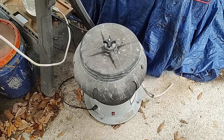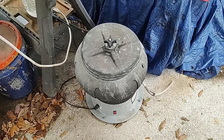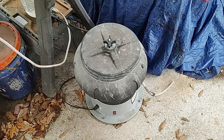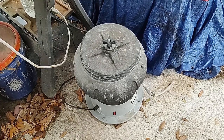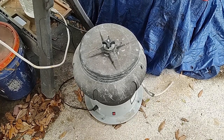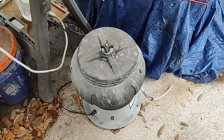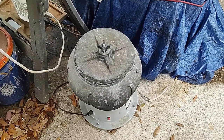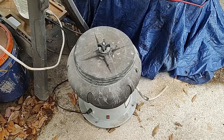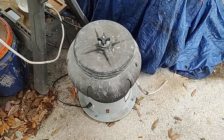I'm getting a lot of comments about running this wet, and that will be an interesting experiment in the future. For now I've got this dry setup going and I'll keep running it dry until I run out of IC chips to process. Down the road, I may put a screen over a five-gallon bucket, dump everything out, catch the balls and big metal bits, and wash everything into a bucket to get a nice wet slurry for further processing. Watch for more updates on this grinder.